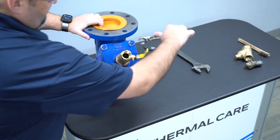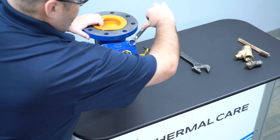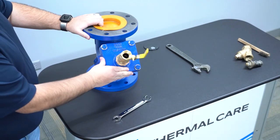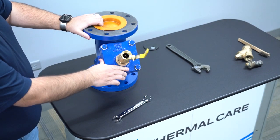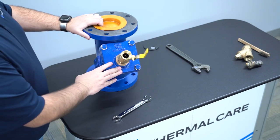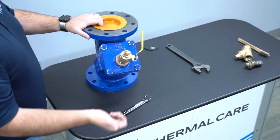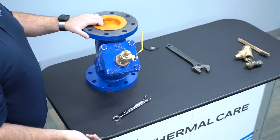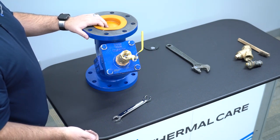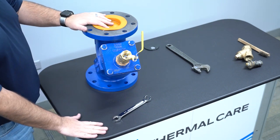The reason for that is if you happen to go in a circle and don't tighten it properly, you could end up warping the flange and causing unwanted leaks. Once the flange is tightened, go ahead and close your drain line and disconnect your drain hose. Slowly open your water line to re-pressurize the system. Once your water's back on, you've now completed maintenance on your central chiller.